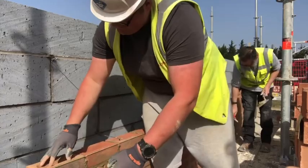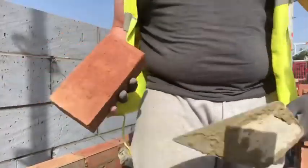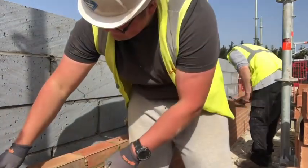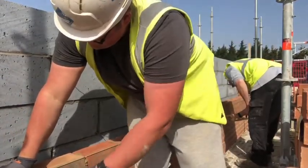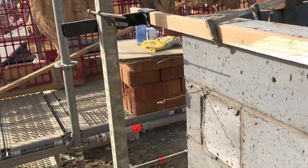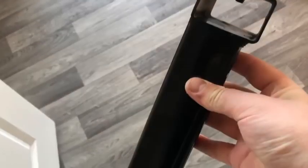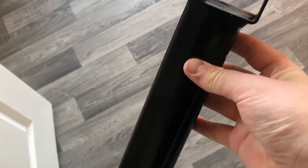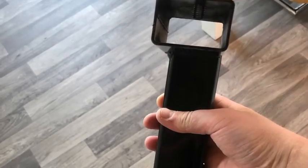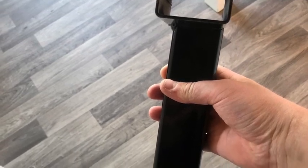When you scrape it smooth on the back of the trowel, the sand and dust will just float into the cavity and you won't get snots piling up at the bottom of your cavity tray — whether you're using a Radon tray system or similar. If you keep it like dust and you've got some coring holes left out, it should just float out through your tray. Anyway, didn't get a lot of footage today but will record a lot more tomorrow — we only had a couple of hours, up on scaffold at about 10 and back down by half 11. Thanks for watching.